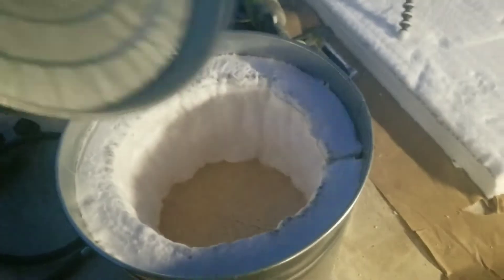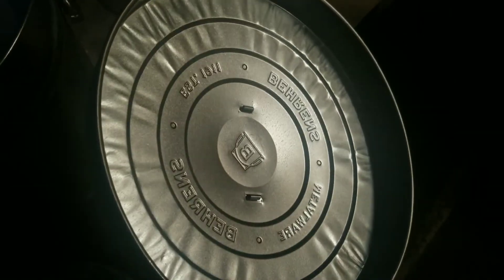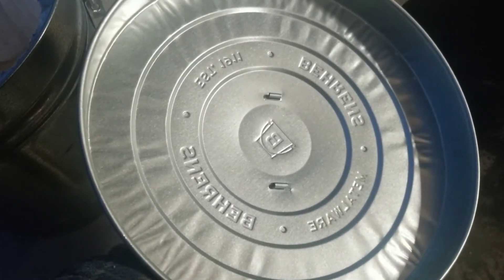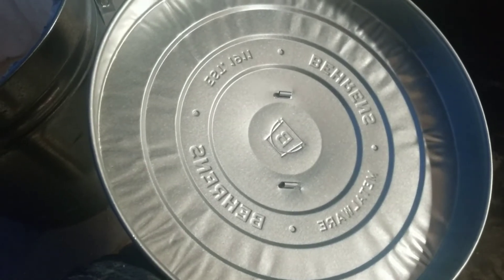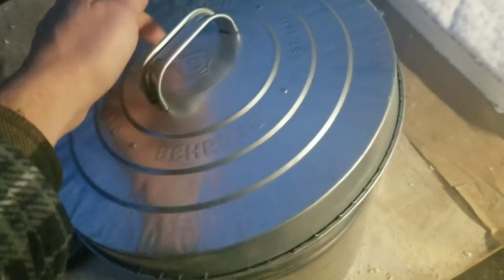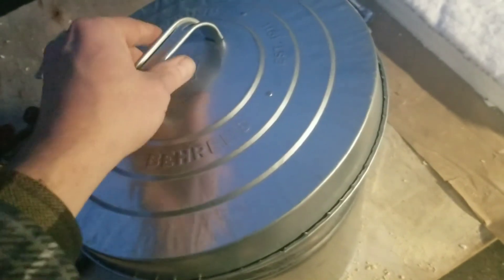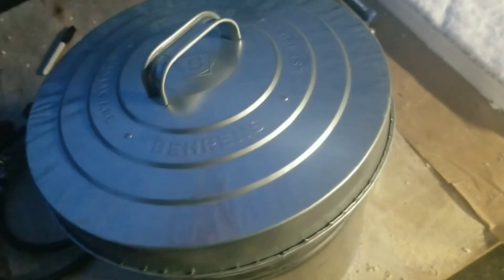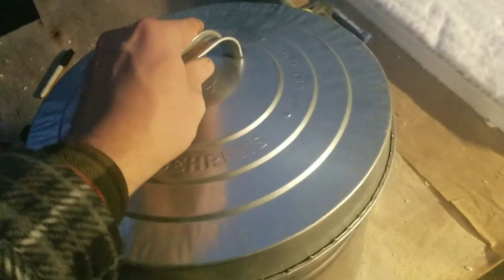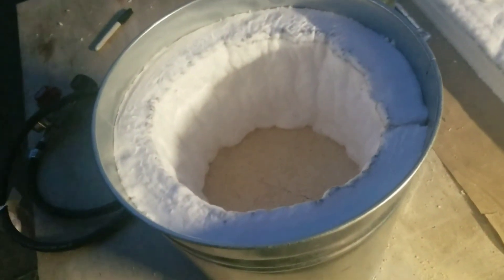This lid is going to have refractory inside it. I'll need to weld some metal anchors to hold the refractory from falling out when it's flipped upside down, and the handle is going to come off. I'm also going to drill a vent hole right here, and I'll be able to stick additional materials down into the crucible from that hole without always having to lift the lid off to stir or add material.